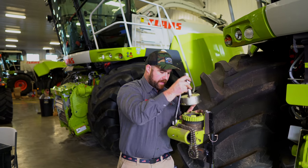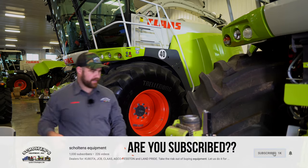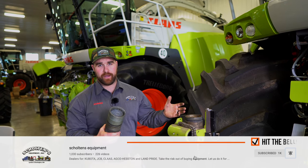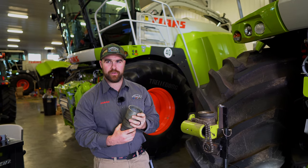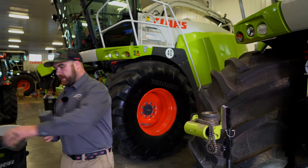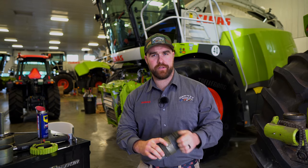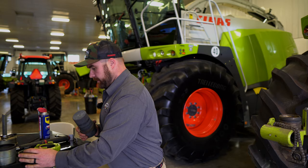All right, so you want to back it all the way out until you remove the retainer ring. Set that to the side and push your stone up and out. Now, I know I was cheating because it came out that easy, but that's the goal of this tip — to make sure your stone is released easily every time. So we're going to take apart our rings here and remove them from the stone. I always like to do this even if we're just doing a simple adjustment, just to try to clean out all the debris in there.